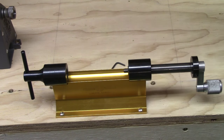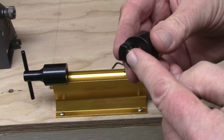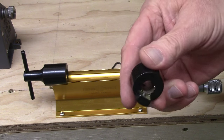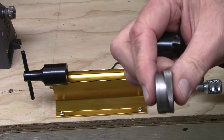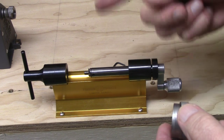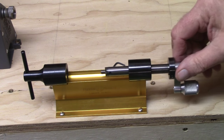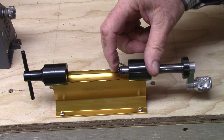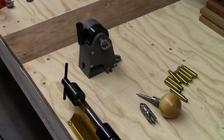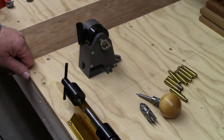What's also nice about this particular machine is that if you want to get into advanced reloading, you can eventually get a neck turning attachment. There's a carbide cutter that will cut excess brass off the outside of the case neck to make it concentric, and it comes with an advancement cam that allows it to advance slowly into the work — just like a lathe, doing outside neck turning like they do on brake drums. It also has inside support pilots designed to go underneath the outside neck turn.